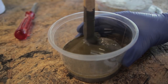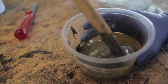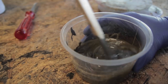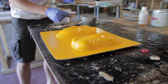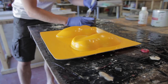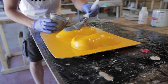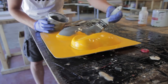I'm using around 30% hardener here — you can see the details on the product listings in the description. As you can see it's very hard to mix at first, so I'd advise mixing for around two minutes to be sure everything is combined. Unmixed resin won't cure and will leave sticky marks on your molds, which is something you definitely want to avoid.